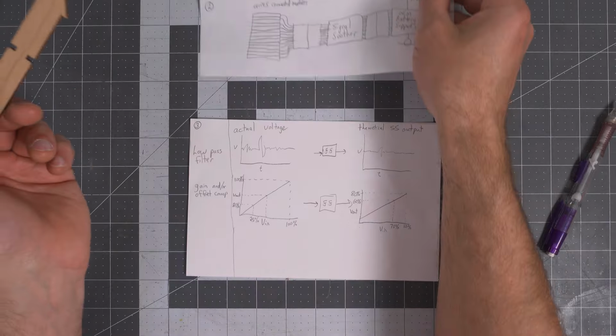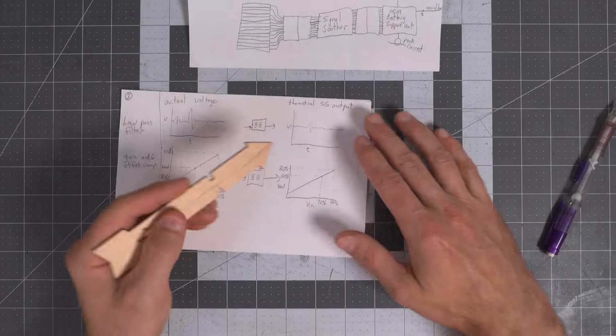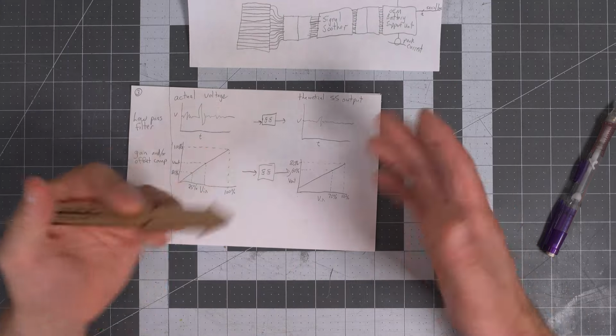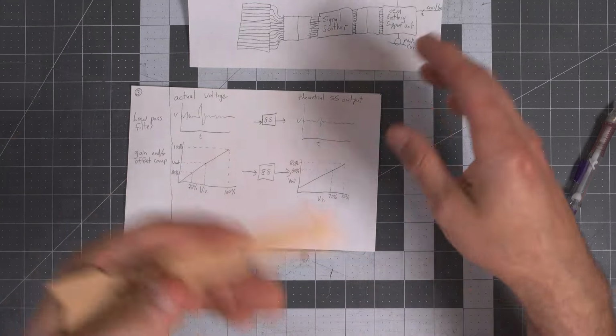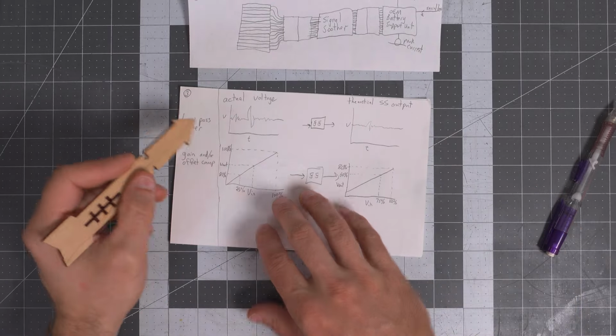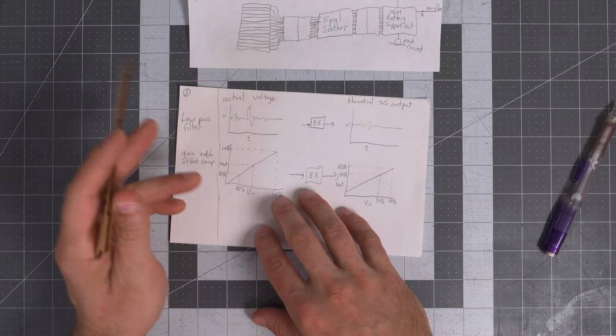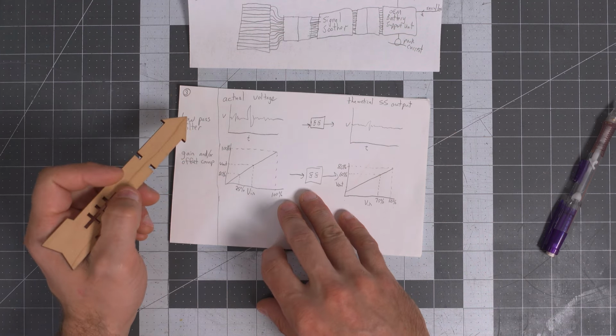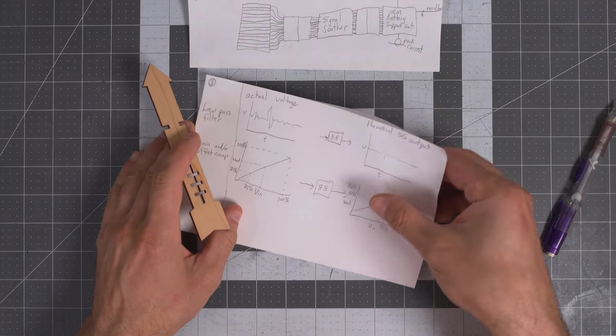nothing there. We're not spoofing it, but just hypothetically, the signal soother might have been taking 100% of the voltage and making it 80% or 75% or 60%, some kind of gain and/or offset thing. None of those were the case. And these were like, okay, fine. The low pass filter in particular, I was like, okay, maybe that's okay, especially if it was a really low pass filter, like over 5 or 6 seconds, but it's not that.